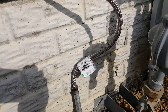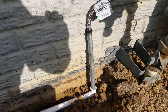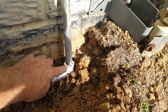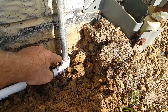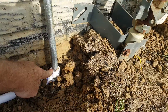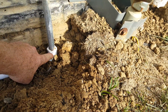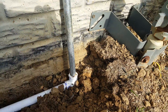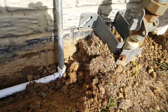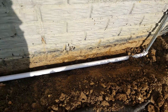That connects to a galvanized half-inch threaded pipe that sticks out of the ground. The important thing is I used a reducer — threaded half-inch into PVC — and glued it into a three-quarter inch elbow. After that it's all three-quarter PVC pipe.